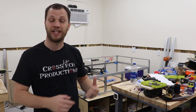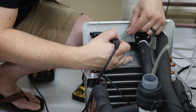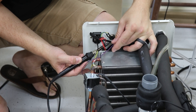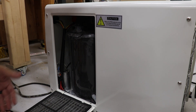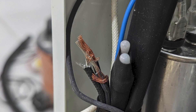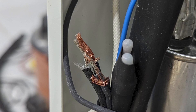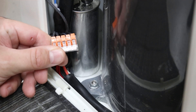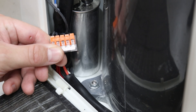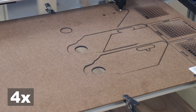So that's what I did last night. I had my friend Nick come over and he helped me cut out some pieces on the laser cutter. If you watched my last video, even though this machine is brand new, it had some wiring problems I had to fix. Even after fixing those, the machine still wouldn't keep the water cold. Nick was poking around and accidentally pulled off a connector on a whole bundle of wires — he discovered that the crimp connector on all the neutral wires was loose. The solution was simple: I replaced that crimp connector with a lever lock one and everything worked fine. We plugged in the machine, saw the water temperature going down, and were able to start making cuts.